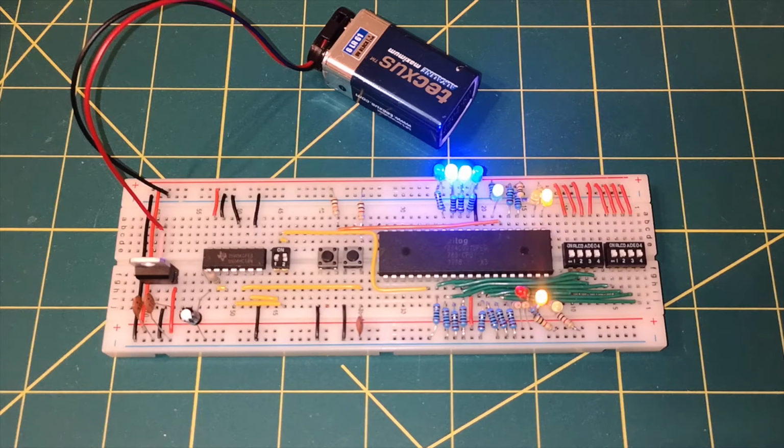But what I'm talking about here is actually designing a computer from the ground up. Okay, so I'm not designing the CPU, and yes, I will use other off-the-shelf integrated circuits or chips, as well as a few other parts, but I will be designing the whole system around the CPU. I will be designing the main circuitry and the layout of the circuit board. So this will involve drawing schematics and designing the layout and all the routing of the tracks on the PCB. Then I'll be soldering all the electronic components onto the board myself.